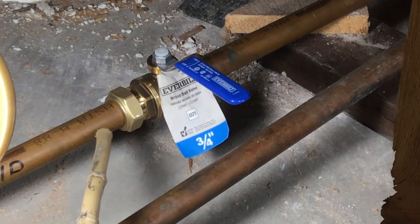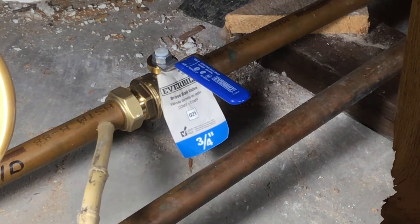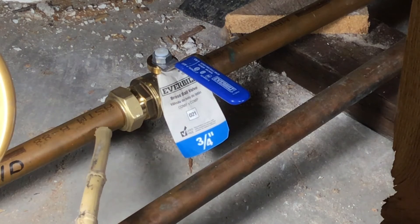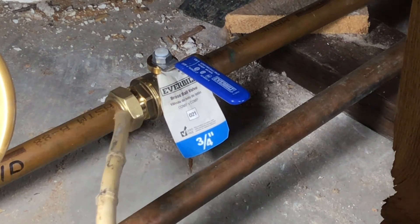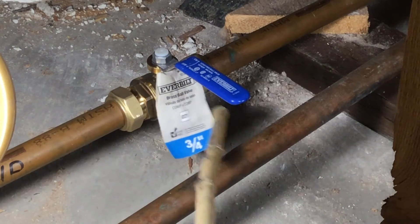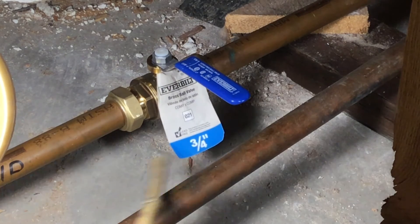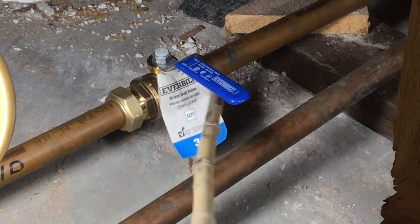So the best convenience is you buy a three-quarter inch shutoff valve with a compression fitting. And you don't need to use a special technique like sweat soldering or welding. You cut it from this end to this end, and then from this end to this end.